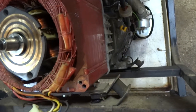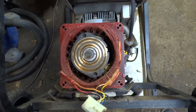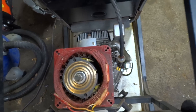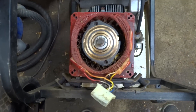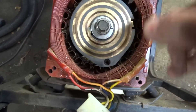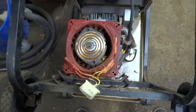Thought I'd just bring you up to speed on what's going on with the generator. It was working, but only one side of the plug-in was working, not both sides. That leads me to believe there is something definitely wrong with the plug-in. And then it went into reduced power. But if you look at that coil, there is nothing burnt — it wouldn't be burnt clear down inside but not burnt up here. I mean, I've seen enough of these motors to know that they don't just burn in one little spot. But I don't see it, so that's where I'm at on this.